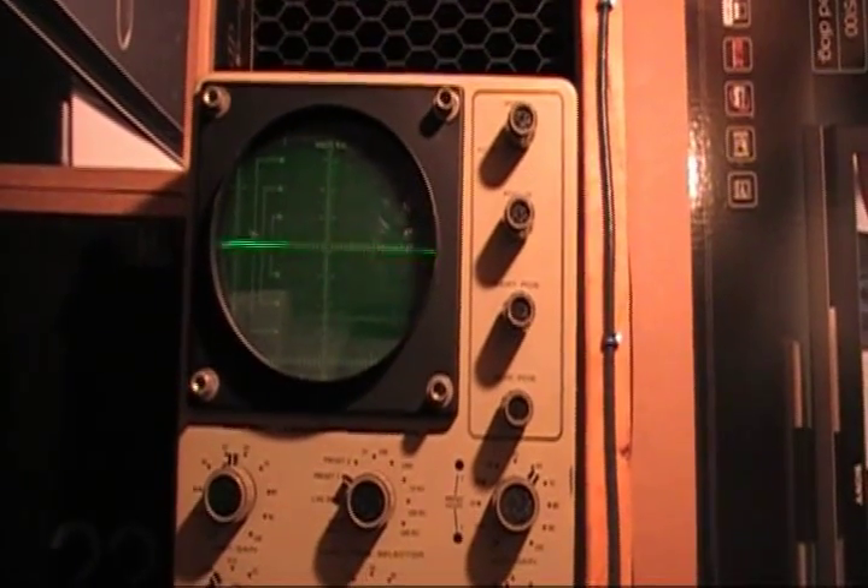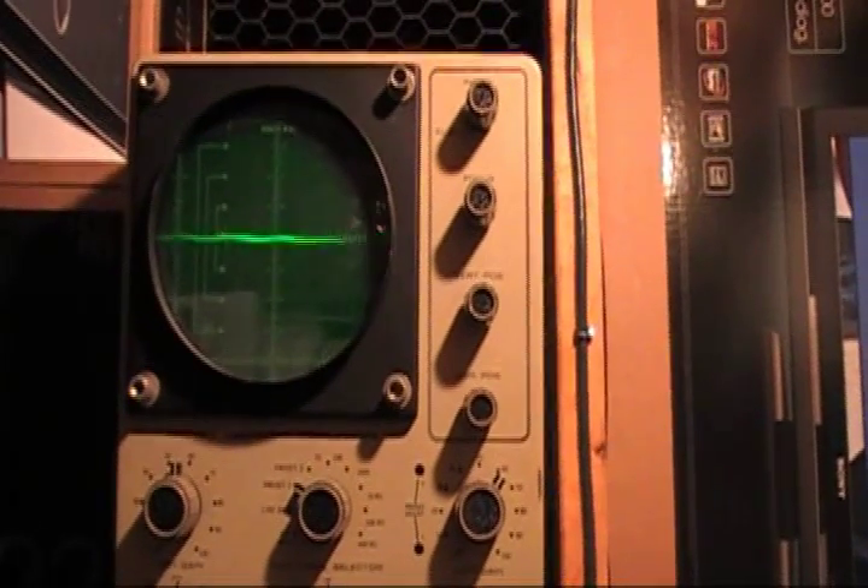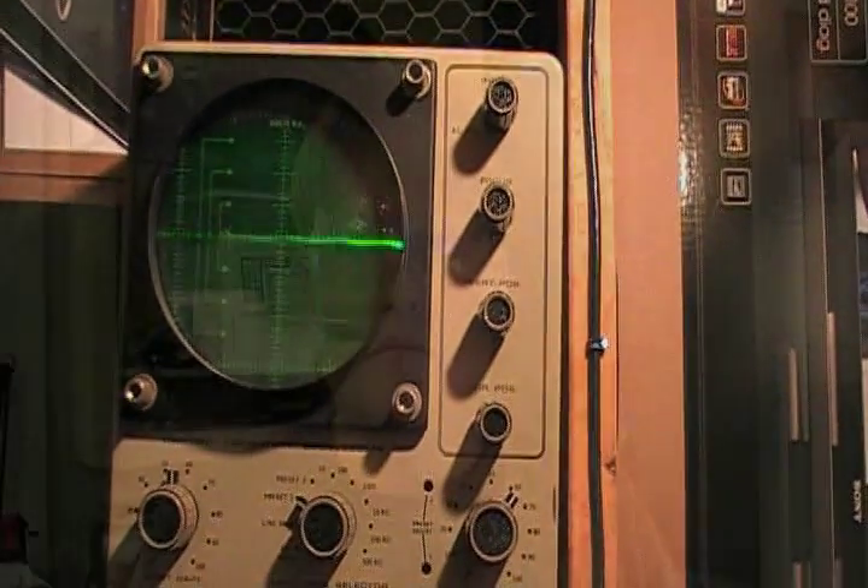Just to make sure the problem is with the digital controller board and nothing else, I've hooked up the board to an oscilloscope. An oscilloscope is a tester device designed to show you the signal from different devices. As you can see, this single flat line shows there is absolutely no signal going to the oscilloscope. So the conclusion: we've performed multiple tests on the Chinese mini lathe motor controller and determined that the problem is with the digital board — something we cannot replace because the part is not available. Thank you for watching, good luck, and see you next time.